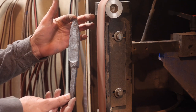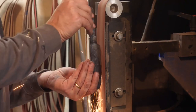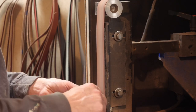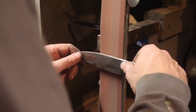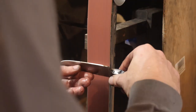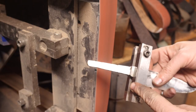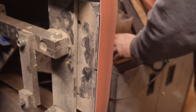It's time for rough grinding on the belt sander — we'll get our profile squared away and start grinding on the bevels. Then a carbide file guide around the bolster area, making it flat all the way around where it will meet the handle material, to help get a nice flush fit between the metal and the wood without any gaps.